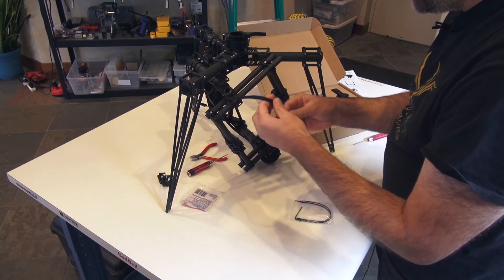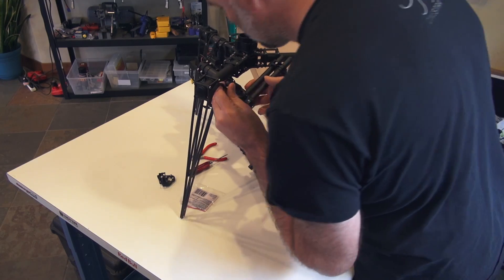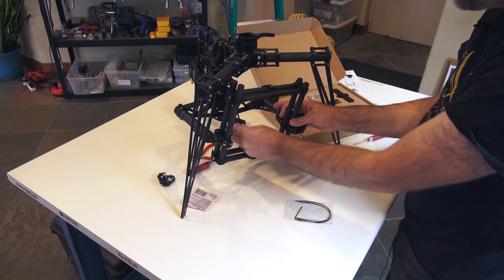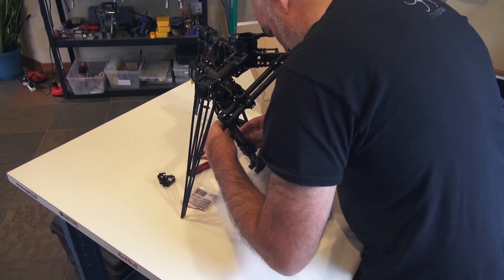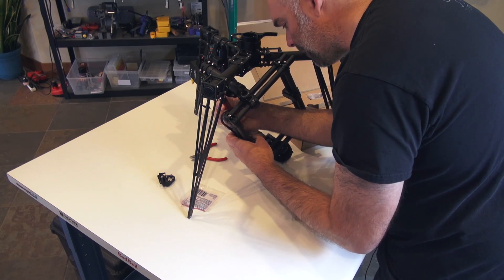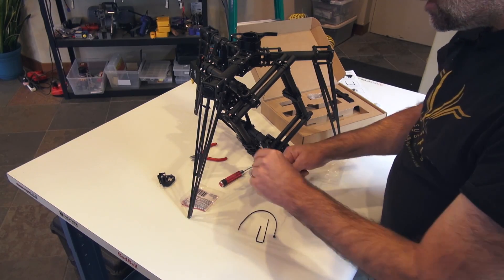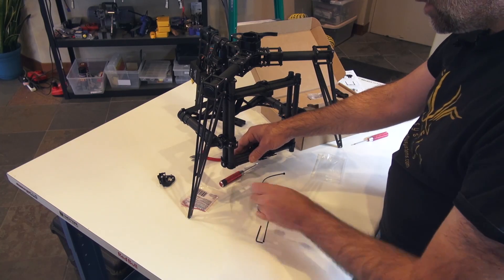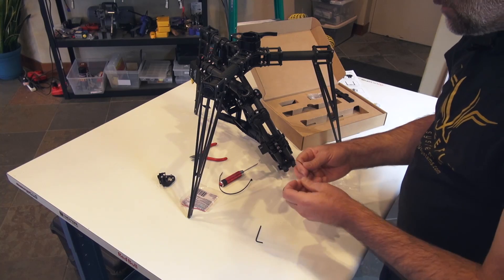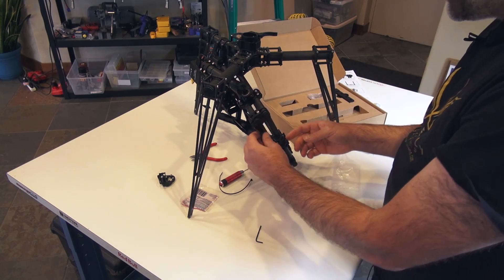The final job is to rethread the wire back through the hole. Make sure it's nice and straight — you don't want it wound as it reaches this opening. We're going to come down and plug it back into the bottom puck. Since my fingernails aren't long I'll use the wrench to fasten it. The last step is taking zip ties and fastening the cable back down — one to the side tube, one to the bottom rail, and the smaller zip tie goes around the puck housing so any strain on the cable won't unplug it.